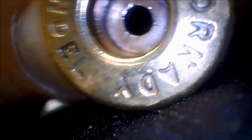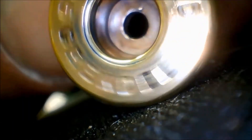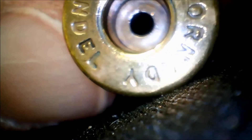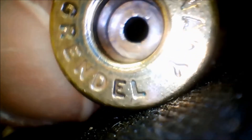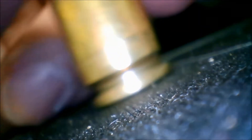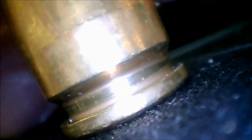Let's look at the inside of the cases. Here's another view of one that has been fired several times for comparison. As you fire it, it tends to hammer out that surface — it's driving it against the bolt. You can see the bulge line there, clearly visible. One thing I wanted you to see is that the actual case head is not chewed up or beat up. I have not been overpressure using loads too hot for this brass — I've been careful about staying away from the max loads.